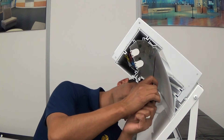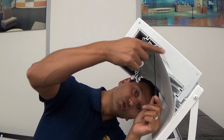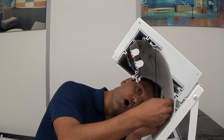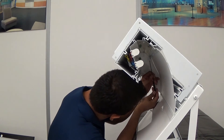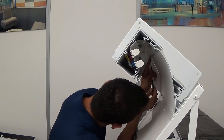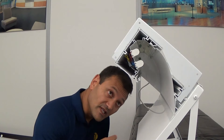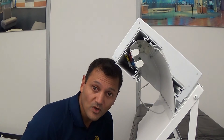Now tighten up the set screws. As you're tightening the set screw, it's going to put pressure on the upper housing and cause that extrusion to move towards the wall. You might have to give the screw a little bit of help with your finger as you're tightening up — you can see that extrusion is actually moving towards the wall. What that's going to do is put tension onto the reflector itself and cause it to maintain a very nice parabolic shape all the way down the run. Continue this procedure with every screw, always working from below the fixture, putting a little bit of pressure on that screw to push it towards the wall as you're tightening. That's going to help it create a very nice tension and a parabolic shape in your reflector. Make sure that you undo all those set screws and push all those extrusions away from the wall to prepare the fixture for reflector installation. We'll go over and start phase two.